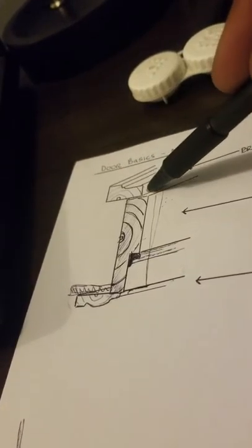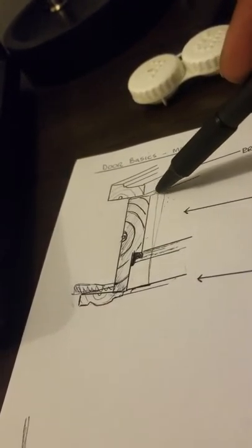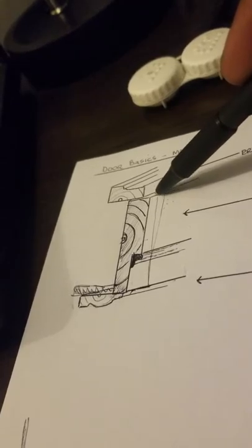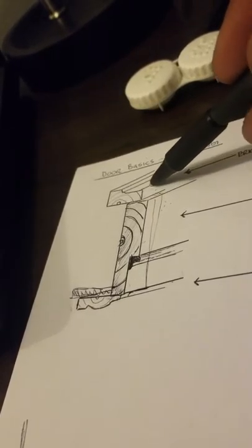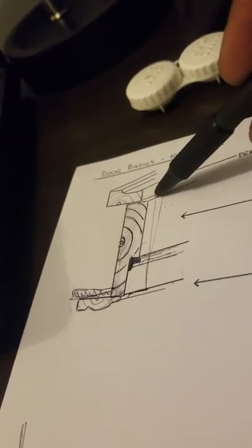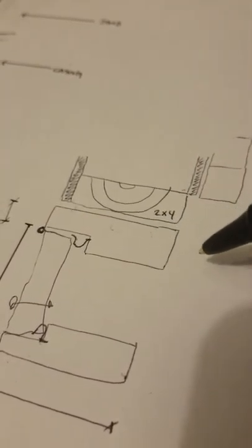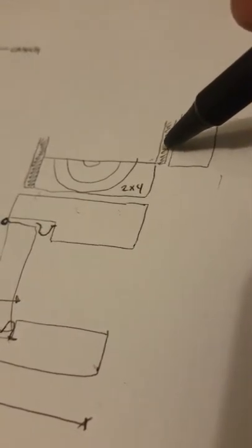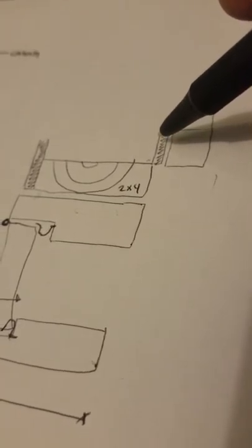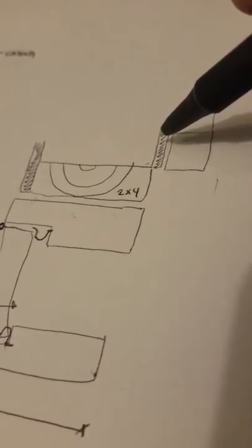The brick mold serves a purpose similar to interior trim. On the outside, it allows the door to have a half-inch setback left or right in the opening — generally away from center — and the brick mold starts from there out to the wall. In most cases when you install a door, you want the jamb flush with the drywall and the door projecting out. Brick homes generally have some kind of substrate behind here — plywood, insulative material, tar paper — but the purpose is to set your door flush with your drywall and let it project outward.